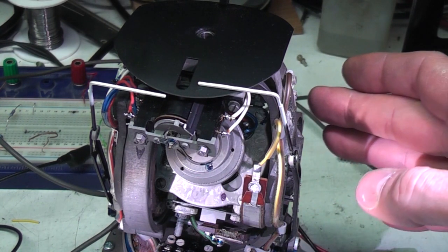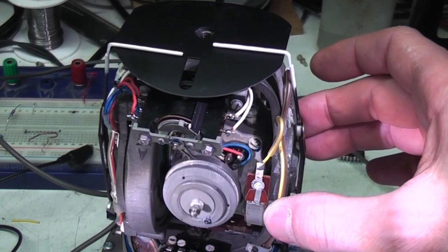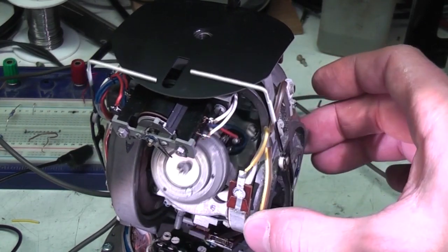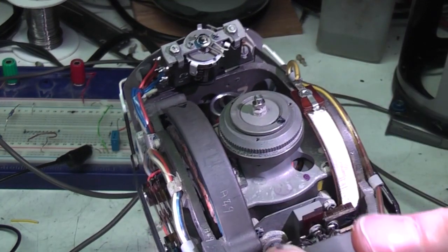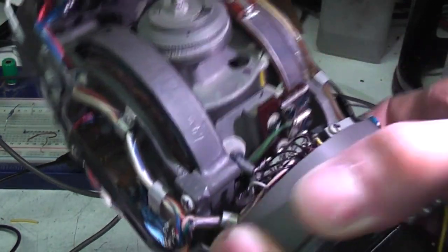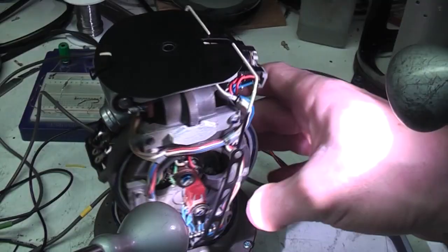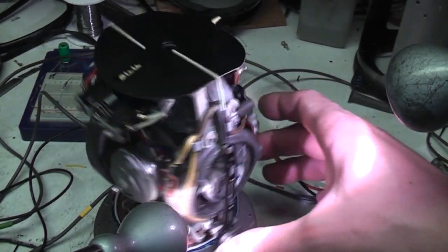And now I'd expect, when I turn this, to actually see some precession. So yes, this is now quite hard to turn, because we're now getting the reaction from the centre gyro piece. It's getting really stiff, still speeding up. So now if I'm moving this, the gyro is trying its best to maintain a position. And now it's stopped, it's freely swinging quite easily again.